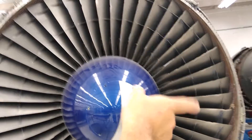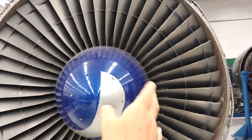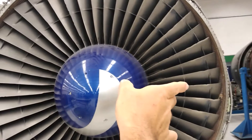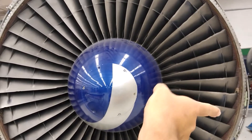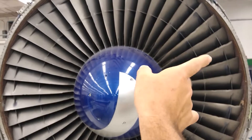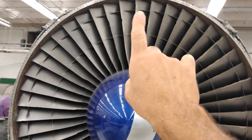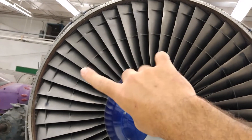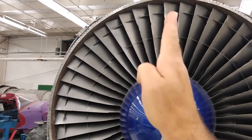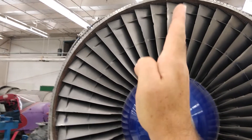As the blades are, let's say, at the 3 o'clock position from our point of view — which would be the engine's 9 o'clock — the blades, by their weight, by gravity, are tilted down, heavy down this way. And as they swing across past 12 o'clock, they tip over; they can't go over to the other side and now they're heavy going down the other way. So as they make that transition from leaning this way to leaning that way, they slap each other.